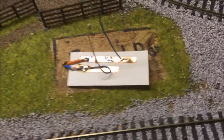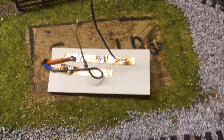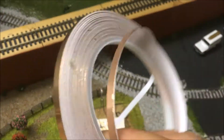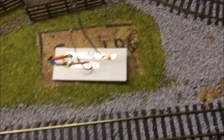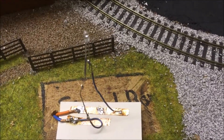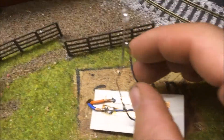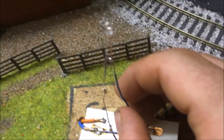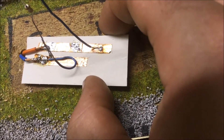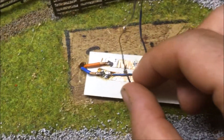What I've done in this case is I've used copper tape — it was about £2.15 from eBay. It's self-adhesive. Because it's sitting through into the roof of the signal box, I've had to add a little bit of wire to make up the height. So I've soldered some wire onto the negative of the LED, which then goes down to the copper tape, and some more wire from the bottom of the resistor to the copper tape.